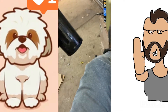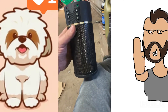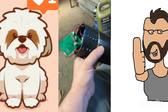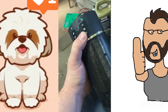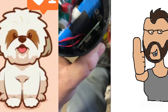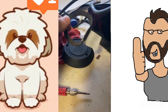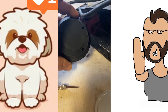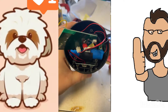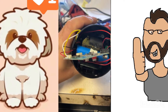Fixing more electronics today. Someone dropped my Bluetooth speaker in the hot tub — see all that moisture inside there. It wouldn't power on at all before, and then after it sat for a while it powered on but the volume button was stuck up and then stuck down — all because of moisture on those buttons on the circuit board. We took the back off: three hidden screws underneath this adhesive, precision screwdriver, popped off the back. Now we're going to dry it all up and sit it in front of the heat vent for a little while to dry out that moisture.